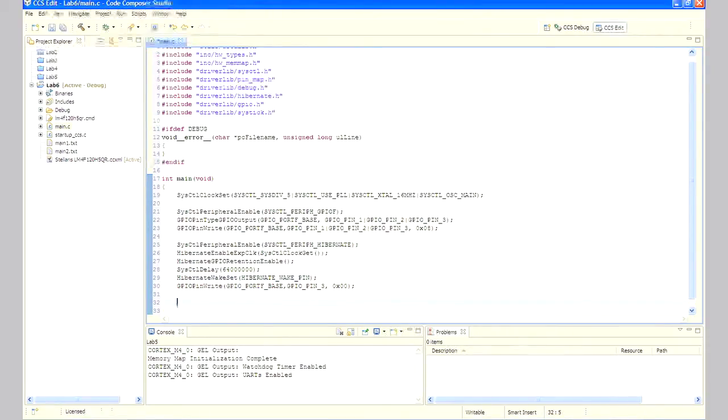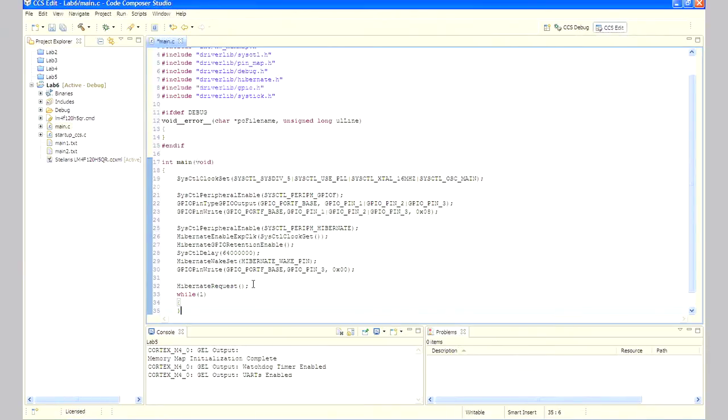If the battery voltage is low, or if your battery isn't present, or if interrupts are currently being serviced, the switch to hibernation mode may be delayed. If the battery voltage isn't present, the switch may never occur. That's a good thing. You don't want your device going to sleep if it can't wake up. The while loop underneath the hibernate request acts as a trap while any pending peripheral activities shut down or other conditions exist. Add a line for spacing, and then add these 4 lines after the last ones in main.